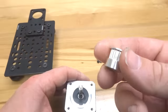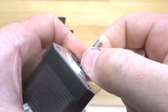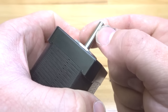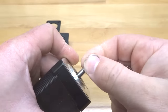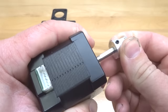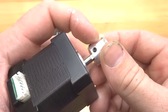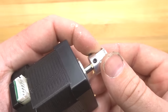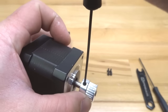Now we're going to strap the GT2 20-tooth timing pulley onto our motor shaft. On the motor shaft you'll see a flat portion — that's for the set screw to lock on to a fixed position. If the set screw locked onto the rounded portion of the motor shaft, it would slip, so you wouldn't have a completely rigid belt and pinion system. Make sure it's on the flat portion of the shaft. Align your set screw to the shaft, leaving a little room between the end of the motor and the end of the shaft. Lock that set screw into place, then lock in the other side.